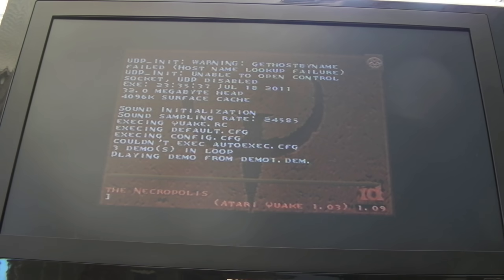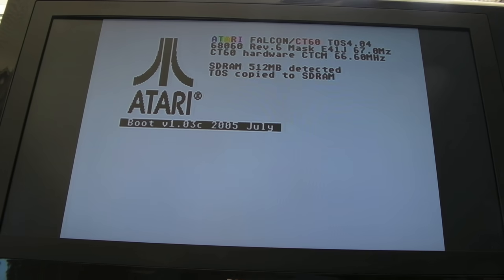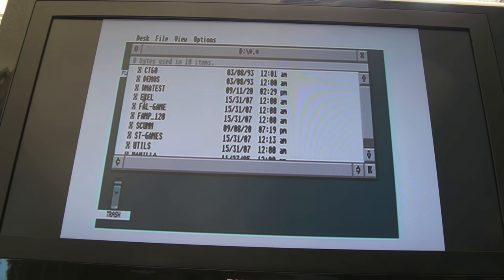The trace going all the way from where the clock signal is produced to the SDMA is quite long, and that's going to pick up noise along the way. The length itself is part of the problem. I think the solution is to add a termination resistor — let's just reset that and try it again. A termination resistor should help with reflection — the same sort of thing as termination resistors on video cables to stop signal reflection, where it bounces back and reflects the other way. Correct me if I'm wrong below.